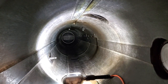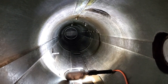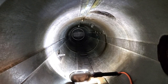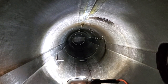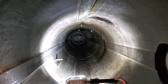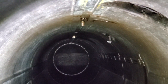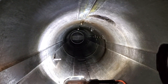Here we are at COD's number one torpedo tube — it's a Mark 32 tube, about 22 feet long. We're looking down the tube. We can see some of the spindles sticking out. If we start at the 12 o'clock position, we see a little guide spindle sticking down precisely at 12 o'clock. That's in a channel that's cast into the inner surface of the tube. There is a guide cleat on all torpedoes that will locate or orient the torpedo precisely while it's in the tube.